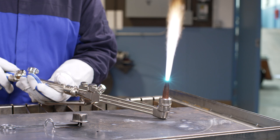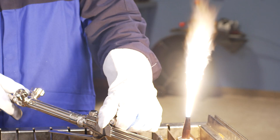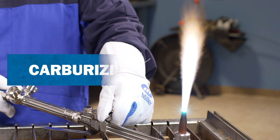There are three basic flame settings. A neutral flame has the proper ratio of oxygen and fuel gas for both to be consumed in the combustion process. If we add too much oxygen, we create what's known as an oxidizing flame — note how the primary flames become very sharp and you hear a loud hissing sound. If we supply the flame with too much fuel or too little oxygen, the result is what's known as a carburizing flame.